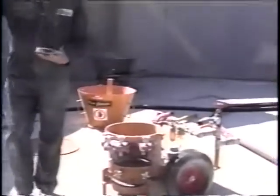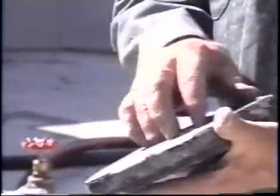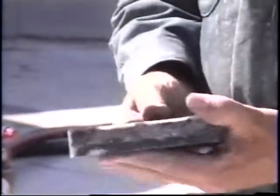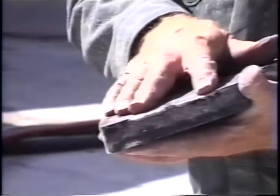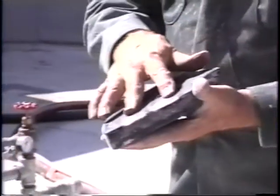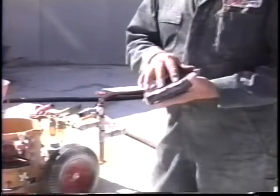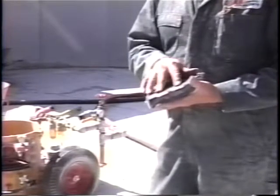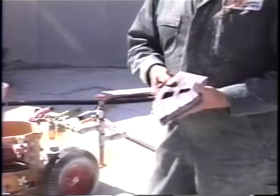This pad is reusable, I would say, with the same material, this pad is probably good for another 3-4 hours. Then you must check it, because if it's starting to get deep, keep in mind, I always feel that the pad is much cheaper to replace if you have a material that's wearing with a good uniform wear pattern. But the more you wear this, the more you're going to wear the expensive steel wear plate. And I'd rather replace these at the price of these than to replace a wear plate.